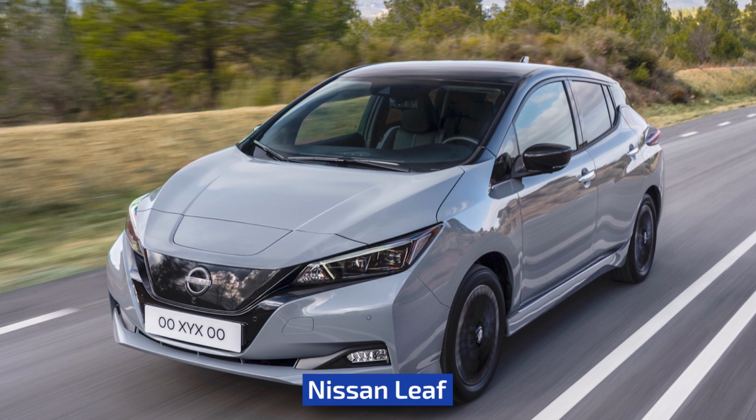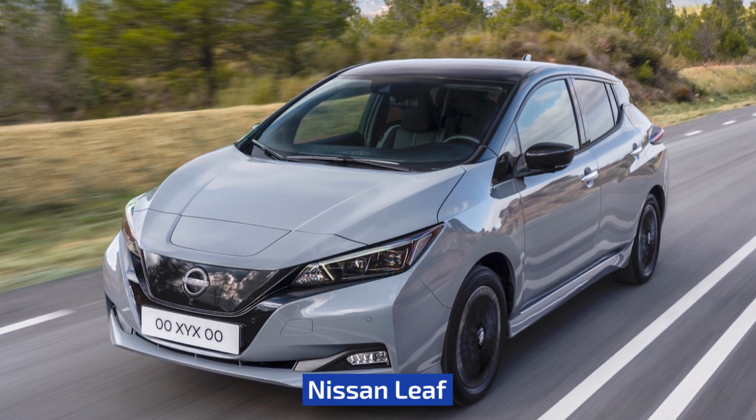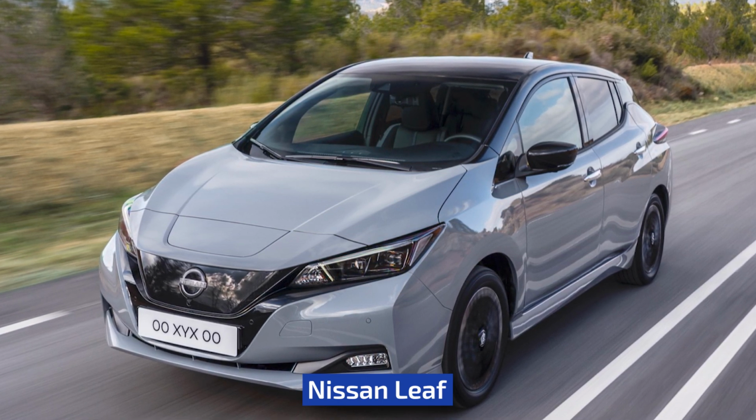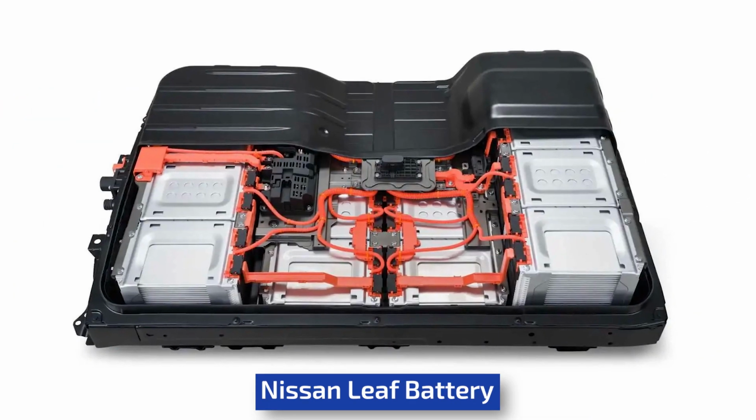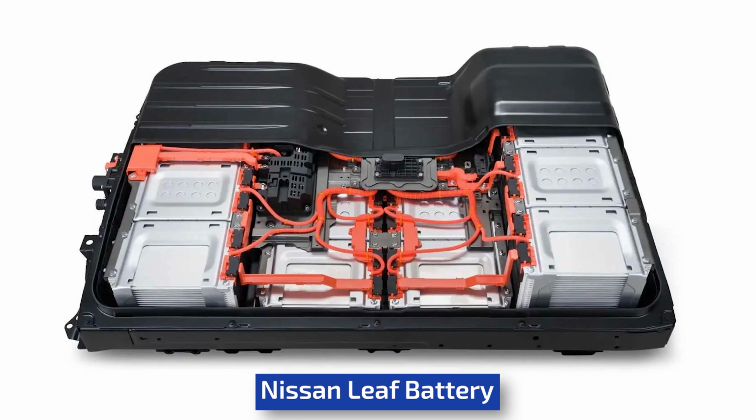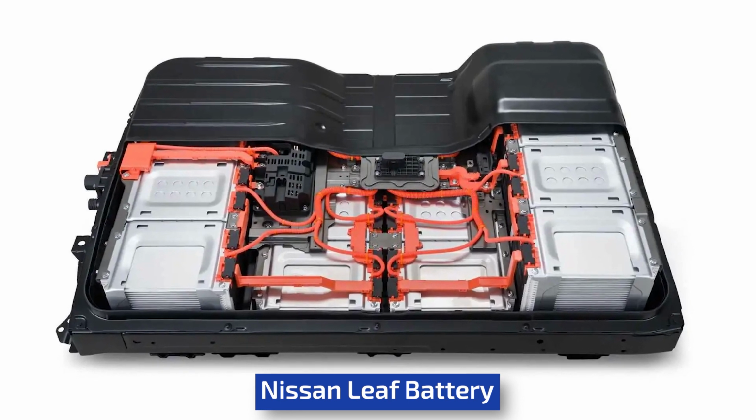Can you test existing batteries? Yes, we can. Part of our components here was testing the second life capacity of some of these cells. A Nissan Leaf is a great example. You have a number of these modules coming off a Nissan Leaf. They've been in use for 8 years, 10 years, what have you. And they might have lost 20% of their capacity over time. And in cars, that's not really usable. You have this whole energy density component you need to weigh in, how much power are we getting out versus what is the actual weight of itself. But for home energy systems, that's not really a big deal. Space isn't that big of a requirement.